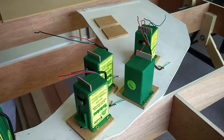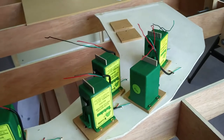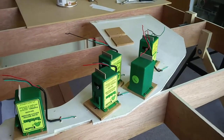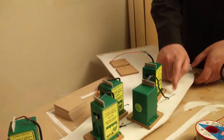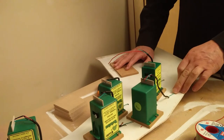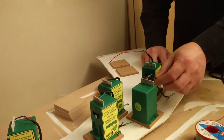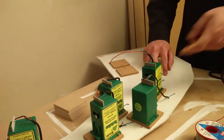The big thing I need to do next is to wire up a DCC accessory controller to control all these points. You'll see here I've got the feeds coming from the track — red and black — going to the two rails. There's a green one here which comes from the frog, and that's the case for each of these points. I've put cables inside a piece of shrink wrap just to hold it all together.